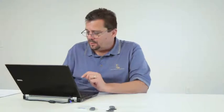The net panel will come as 2 units as a kit. You'll get the wireless reader in either a digital lock or prox digital lock. You'll have a separate panel. In the panel will be the radio, and a terminal strip, and on that terminal strip you'll have door position switch, request to exit. You'll also have a battery backup and plug-in transformer, so all ready to go.